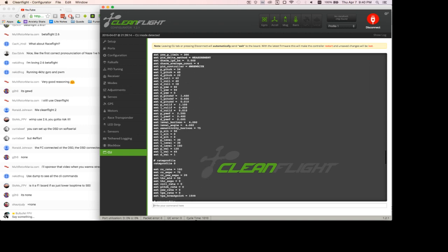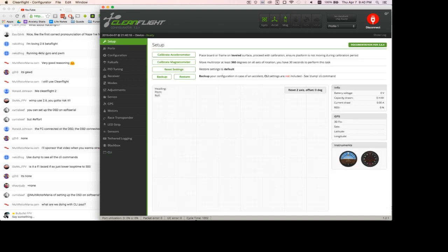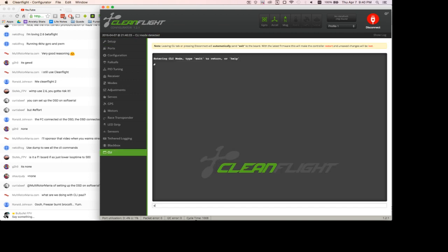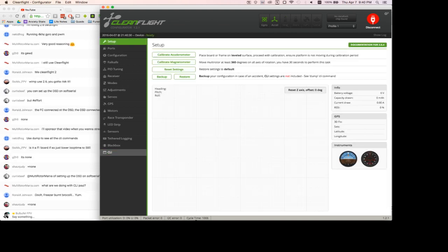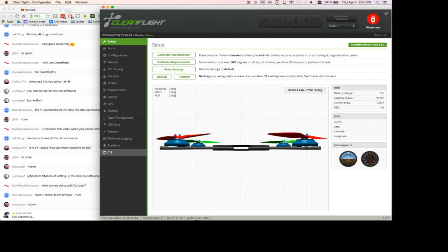Okay, what was the compass? Is it just compass? Set mag hardware equals none. Save. There we go. Thank you guys so much. Set ACC hardware equals off. Or is this also none now? Okay. All right. Now we can set a loop time of 500.